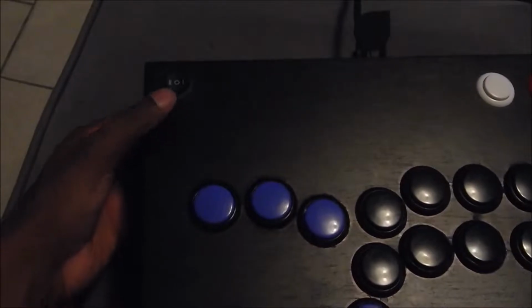But this video is where I show that I added a rocker switch that allows me to control the three directional inputs: the D-pad, the left stick, and the right stick. The Brook Universal Fighting Board allows you to control that with a rocker switch, and AliExpress has a seller that sells the rocker switch and the wiring harness. For those that don't know, AliExpress is located in China, so it takes a while to get here. I got my switch for $5 and it took about a month to arrive.